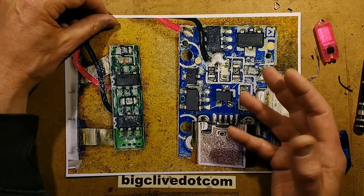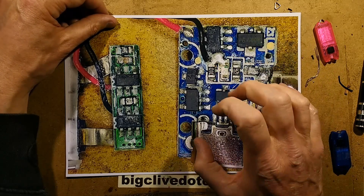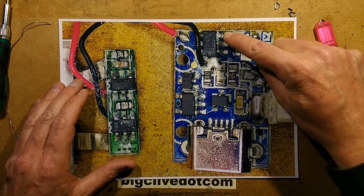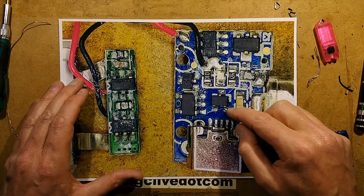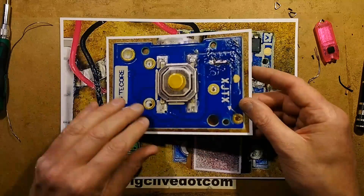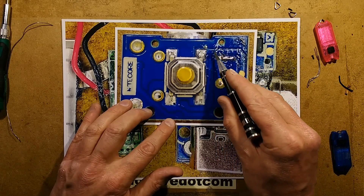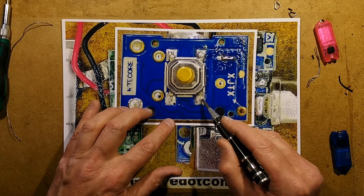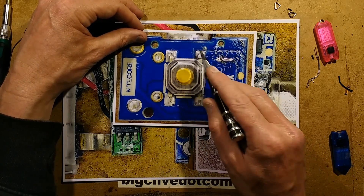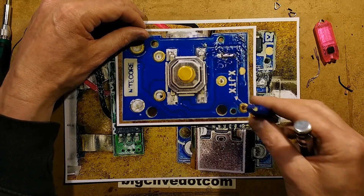After that, the unit was very intermittent — I just couldn't get it to operate at all. When I pushed the button, it didn't respond well, but the light was flicking on and off by itself. It turned out, after an awful lot of investigation, I had to trace all the connections to this chip. This pin is used to detect the button being pressed, this one is one of the power rails, and this one is driving the transistor to switch the LED on. What was actually happening — down here, corrosion had occurred between the pad carrying the low-current switch signal to the processor and the negative rail it's referenced to. Because it had been corroding in there, that bridged it out. I actually thought the switch might be faulty, desoldered and removed it, then spotted the big patch of corrosion under there. I scrubbed it all away, checked the switch — the switch was fine — soldered the switch back in, and that's what actually ended up fixing the fault.